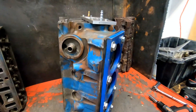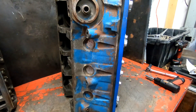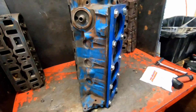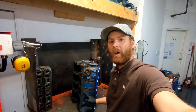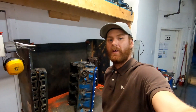For the test to work, the plugs need to be in. I don't care what you call them — frost plug, core plug, welsh plug, expansion plug — personally I call them expansion plugs because when I buy the kit it says expansion plug on the package. When I tore this engine apart and put it in the hot tank I left these plugs in on purpose, because I knew they were probably still sealing and I need them to seal for the test. They will be changed afterward.